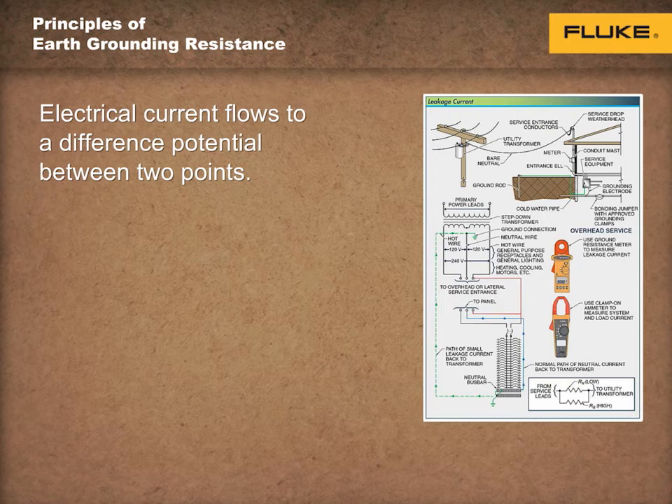Since the points at which the utility is grounded and the service is grounded with a low resistance conductor, the conductor carries most of the system neutral current back to the transformer. The amount of current flow through the ground electrode back to the transformer is typically in the range of 5 to 100 milliamps. Any current over 5 milliamps should indicate the source of leakage current.